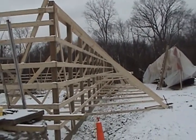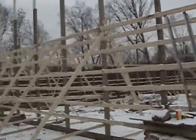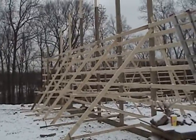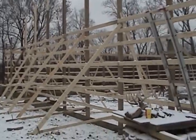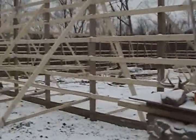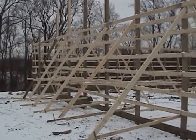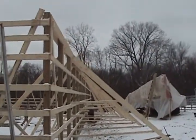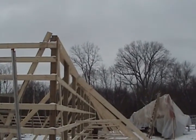We've A-braced the one gable end wall, which we're going to start with our 80-foot truss. You have to put these A-braces on — 2x6s braced in about 4 different places — or these big trusses will move with any type of wind. Same way on the side wall. We bring a string up on top and we have it perfectly straight.